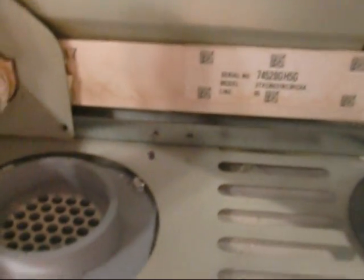Got my new pitot tubes here and I'm going to do another static pressure test. They won't actually work where I had them last time over here — there's no way for me to get my pitot tube in there, it's hitting on the pan of my coil pan. It's not long enough for me to get in there.